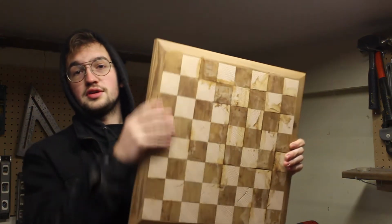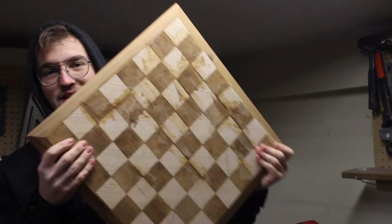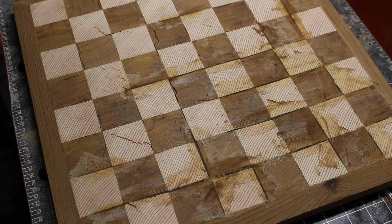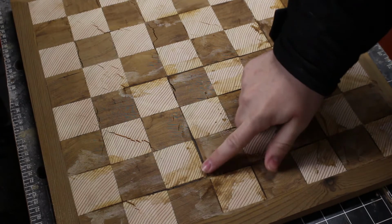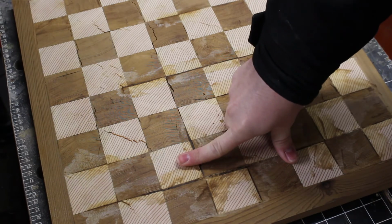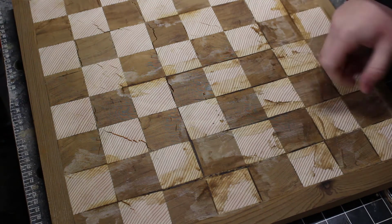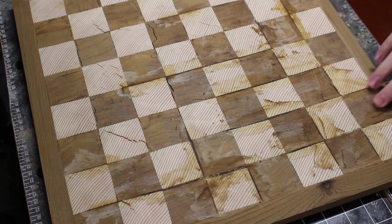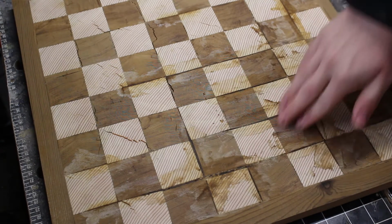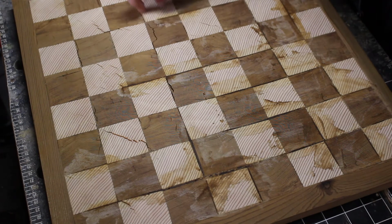But anyways, here we go. I glued on these sides. It's honestly a 2-footer. If you look back from here, it looks pretty good actually. But let me zoom in closer and we'll pan down and I'll show you. So, unfortunately, there are some cracks along the wood where I believe the pine or the Douglas fir shrunk. And you can see it happened largely on this side where I didn't quite get the glue gaps, and that was a bigger problem. But over here where I had some real tight joints, they actually cracked in the wood.